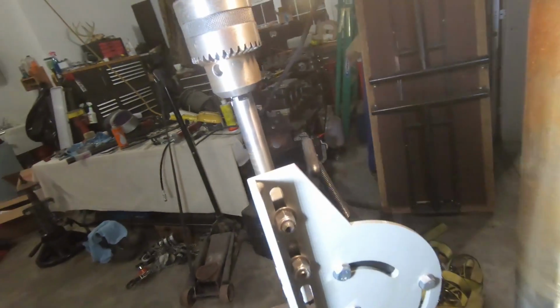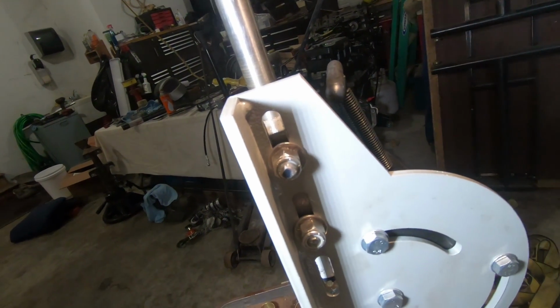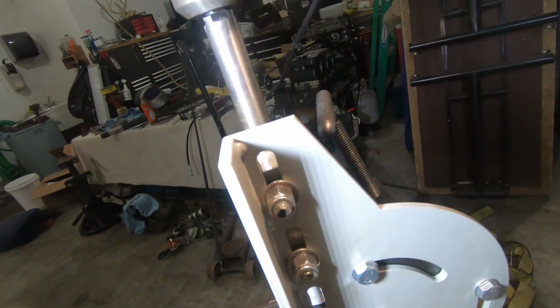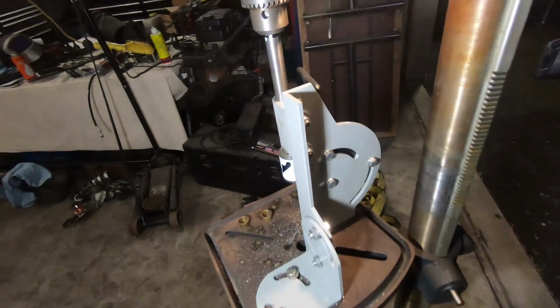And also, I drilled out this rear bracket and put 3/8 studs in there. I had actually stripped one of the bolt holes. So we put 3/8 studs, and they fit in that slot once you get the paint off it, nice and tight. So that's another place we're tight there. Hopefully this will make our notching much easier.